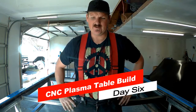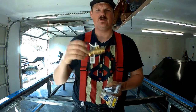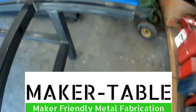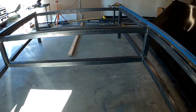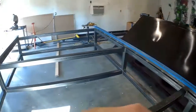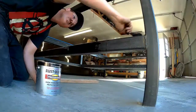Day six out here in the shop. I've got the bottom of the waterbed welded out. I went to Lowe's this morning and picked up some paint and also the stuff I need to install that little ball valve so we can drain and fill up the table. I've got the cold rolled steel rails masked up with blue painter's tape, with the masking wrapped underneath. Everything else can be painted. I'm going to knock that out right now and then get the waterbed set back up and start welding out those little angles.